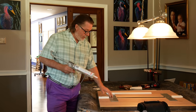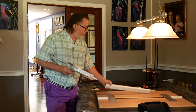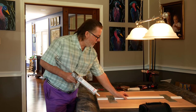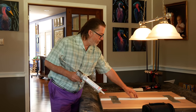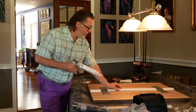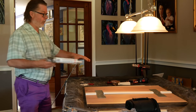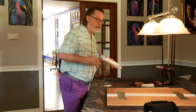Now that I have the two pieces connected with the metal brackets, I'm going to silicone in this plastic molding to fill the river section. This is the bottom, so I'm blocking it with this plastic and using silicone to seal it down. Then I'll flip it over and silicone the other side too — the idea is to make it a waterproof environment so I can pour the resin in without it leaking out.